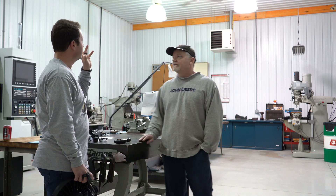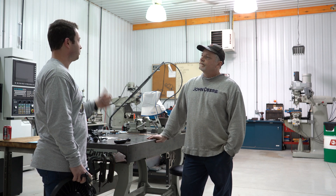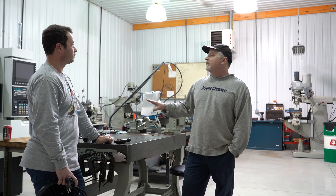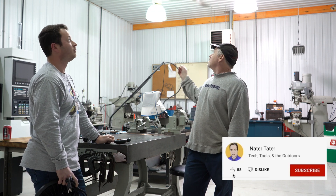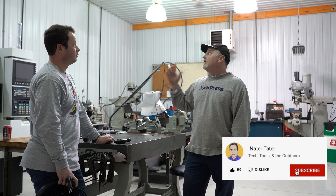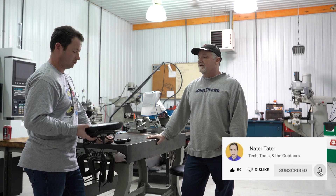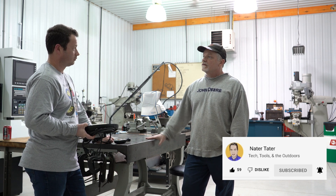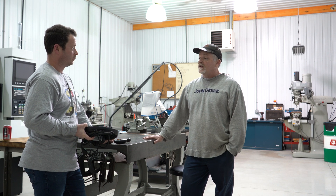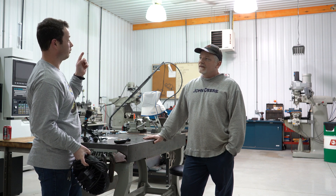Right now you have six lights in here. About how big is this space? It's 24 by 40 feet, and the barn was built about 15 years ago. We put these lights in at the time and they were used — they were much brighter then obviously. But we've been waiting for LED technology to mature to a point where you could go into a space like this and save some money while putting out a lot of light. Each of these is about 400 watts and they're on 220 right now.